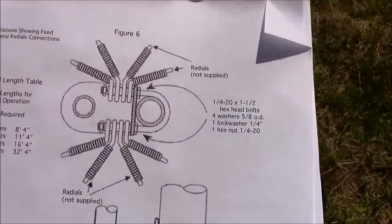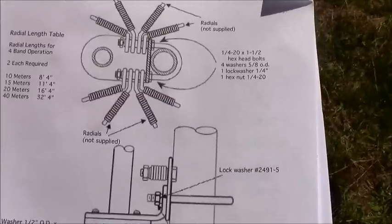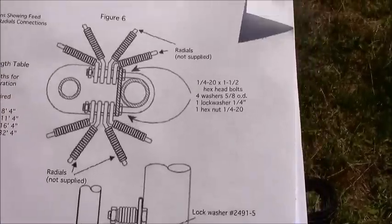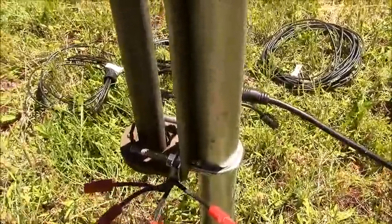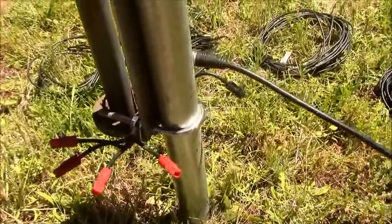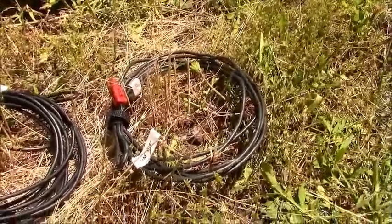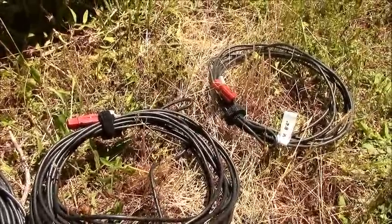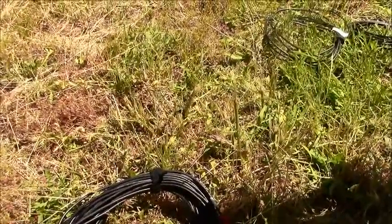I replaced those just as shown in the diagram, but when we deployed to a training exercise people kept tripping over the ground radials and ripping them out, eventually tearing everything back up again. So what I did was replace all of these connectors with Anderson connectors. Each one of these radials is a different length for various bands — I've got 10 meters right there at eight feet, 20 meters at 16.4 feet, there's my 40-meter radial, and there's my 80-meter radial.